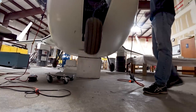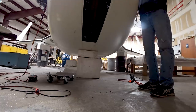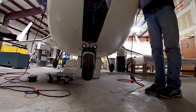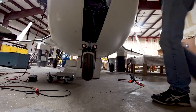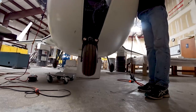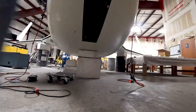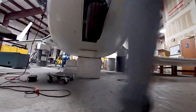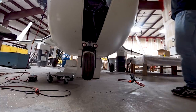I did some more work on the gear — here it is retracting, and there's a little duck waddle. We've talked about it and I don't think there's much you can do, because everything is teed off one line. One side gets a little heavy and fluid flows back to the other side. You can't put them in series because one gear would always go up first. I've got the dump mechanism sorted out — opening the dump valve half brings the gear down, but the pump system has a little locking valve you just touch with a tiny bit of power to release, and the gear dumps down.